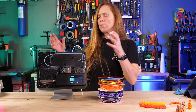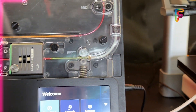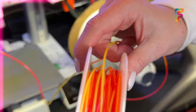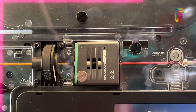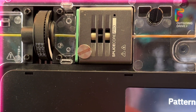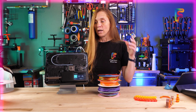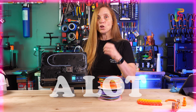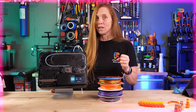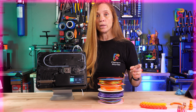Mosaic Manufacturing's plan for 3D printing is: calculate, splice, and send. They're working with the G-code and looking at what filament comes next. They're going to send 55 centimeters of red over to your printer, and your printer's going to start printing. As your printer gets going, it'll pull enough filament to get to the yellow, so Mosaic will splice the yellow in and your printer keeps printing. 70 centimeters later, we need to send green, then blue, and so on. Your printer has no idea it's printing anything other than a single color, because one strand of filament is coming in. And given the fact that these guys are experts in splicing, we're going to use that to make our own filament that should be very strong.